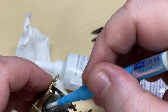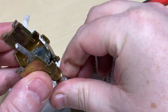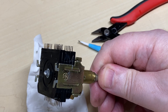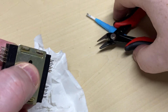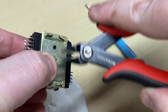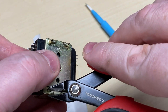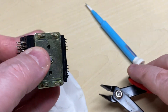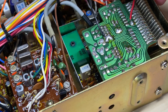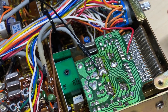Just finishing off the greasing using some synthetic grease. Excellent, feels absolutely lovely now. We refitted the wafers back in - if you put these wafers back in wrong you're going to go into a whole heap of trouble, that's why I marked them up. We'll just readjust the locking lugs. There's our channel change back together. If we had faulty digits we could take the wafers apart and clean them.